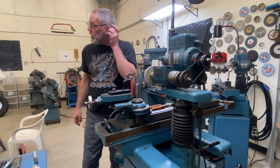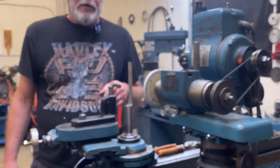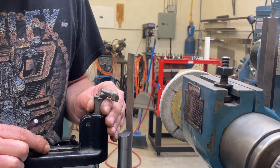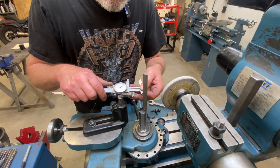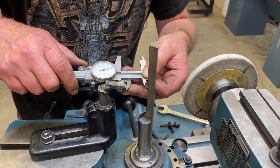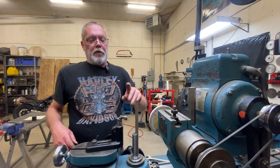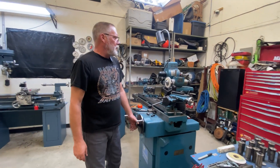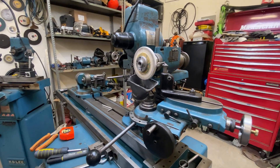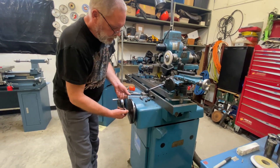I measured that radius at an inch and a quarter - there was a two-and-a-half inch diameter piece that fit in there just about perfect, so the radius is inch and a quarter. I need this diamond centered and an inch and a quarter away. There I'm exactly an inch and a quarter away; I can lock this in place. Now I know I'm going to cut the exact radius I want. Next I need to get the height of my wheel perfectly matching the height of my diamond dresser. I've got my wheel and dressing tool at center height, and I've set the radius I want to cut. Now I'm going to engage the low range on my table travel so I can more accurately feed the diamond into the grinding wheel.